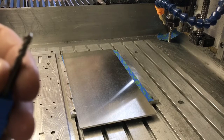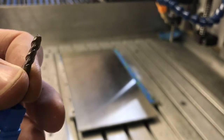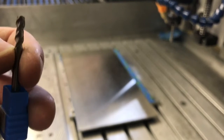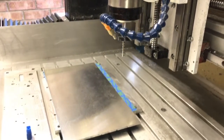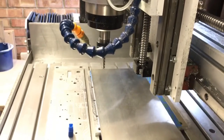Let's get it in. So there's a nice little 2-flute. It doesn't have much stick-out - it's got a flute length of around 10mm. I'm going to fit that into the collet now. We'll just line up and bring that forward so I'm not reaching too far. Alright, I've got a 4mm collet to go in there.